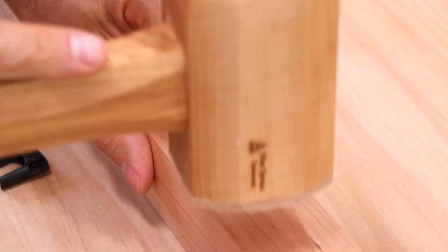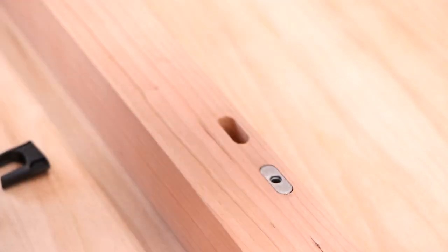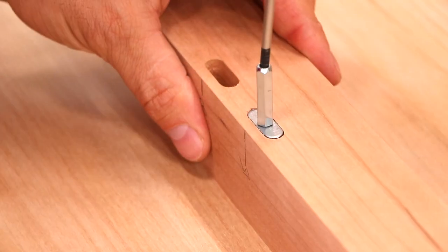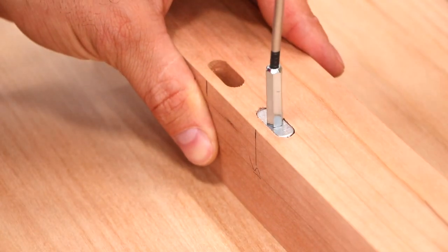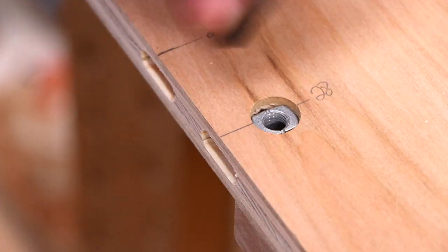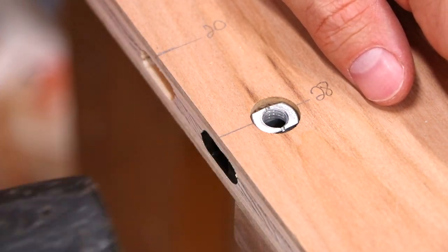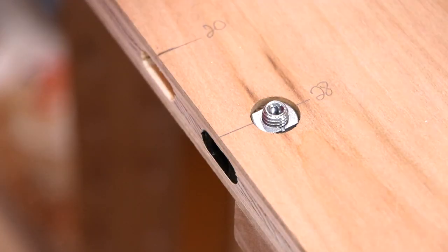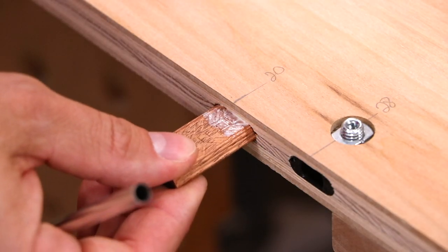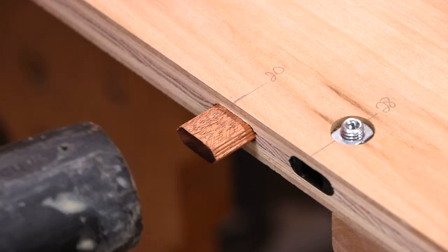Into the 15mm leg hole, we can drop the post connector thing, flush it to the surface, and then screw in the post. Now we can add the threaded locking piece into the drilled hole as well as the plastic retainer. And finally, a set screw is inserted just enough so that it doesn't fall out. I'll glue my 40mm Dominoes in place on the panel side. We want those permanently attached to the panel, but not the leg.